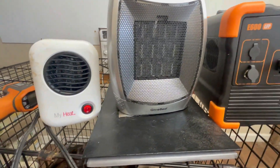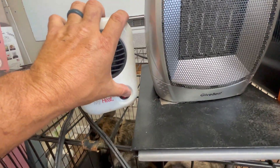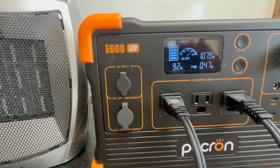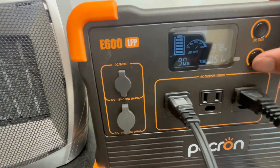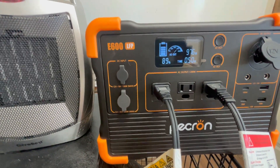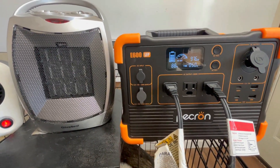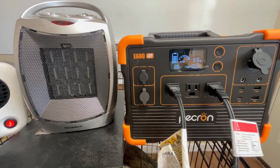Let's add a second heater — I think it's about 200 watts — which should push it right about to the max. With both running, we're spiking and pushing towards 1,000 to almost 1,100 watts. Running it at around 1,000 watts, it's not really made for this large a load for a long period of time with only a 614 watt-hour battery. But I wanted to push it to its limit, and it is performing just fine. In a grid outage scenario where you needed to run a heater in a small bedroom, this would last probably a half hour to an hour.